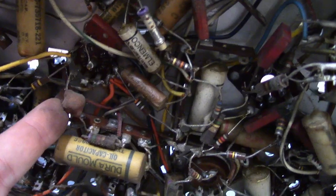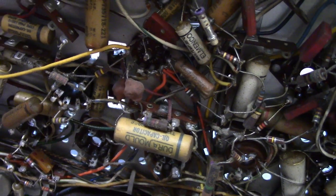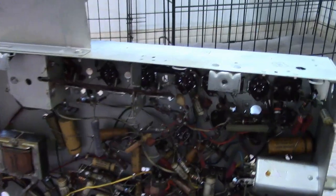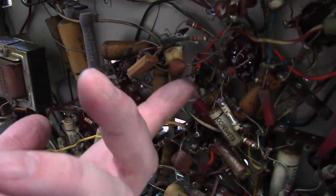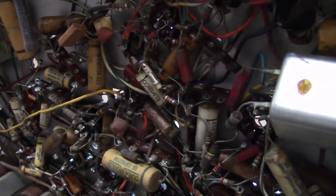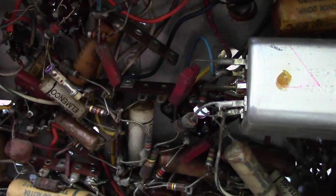The peaking coils — maybe. That's what these little blobs are: there's a coil inside here that helps set the frequency response of the video amp. There's another one up here. The problem with trying to reuse those is you really need to get them right if you want to optimize the performance of the set. Looks like they used quite a few of these blobs, and they're not marked with a part number or a value — I wouldn't bother. These mica caps — yeah, except they fail over time too, especially if you twist them because you can break the little seal between the wire and the capacitor body, and air and moisture can get inside.